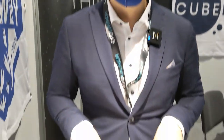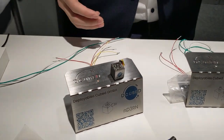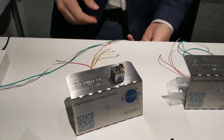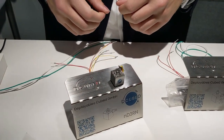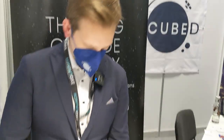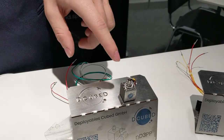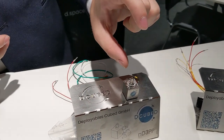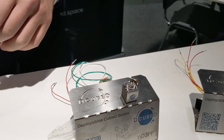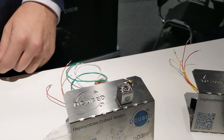And these are our actuators. These are release actuators designed for holding things down and releasing them when they need to operate in their environment. This is a release nut that holds down an M3 bolt. The pin puller is a pin that extends and holds something down from the side, blocking a rotational motion, and then when you need to unlock that motion, it retracts.